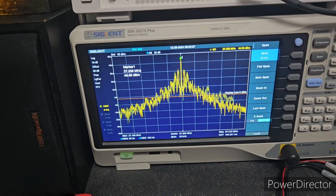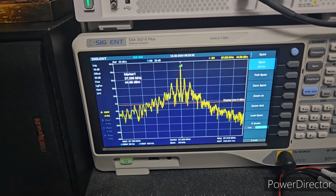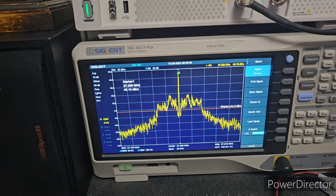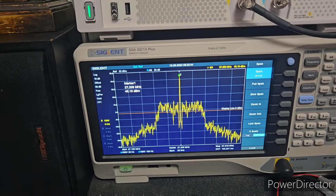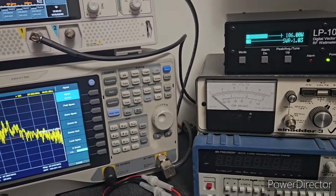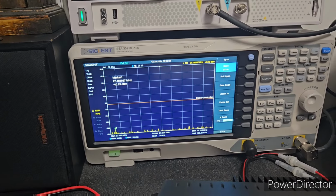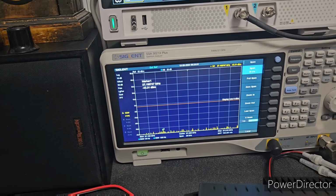And you get a 3-year warranty with this radio. You start swapping parts out and doing stuff, then obviously you're going to jeopardize that. And why would you buy a radio like this that has that if you didn't want to maybe have to use it at some point? I'm not saying somebody will, but it's kind of a peace of mind knowing that it's there if need be. So that's what the radio looks like anyways on AM. It looks good. I always set it to about 96% with the test tone, which equals out to be a good level. It doesn't overmodulate or anything like that.